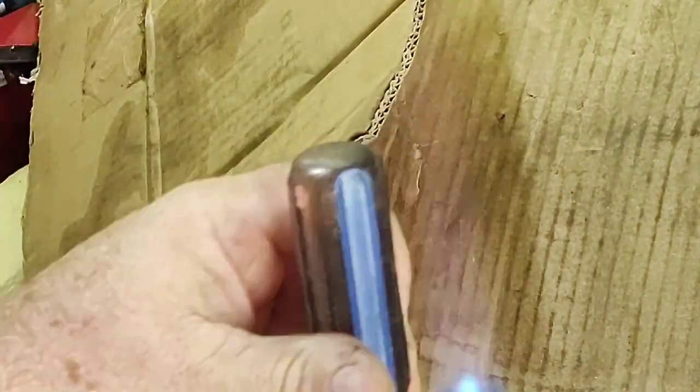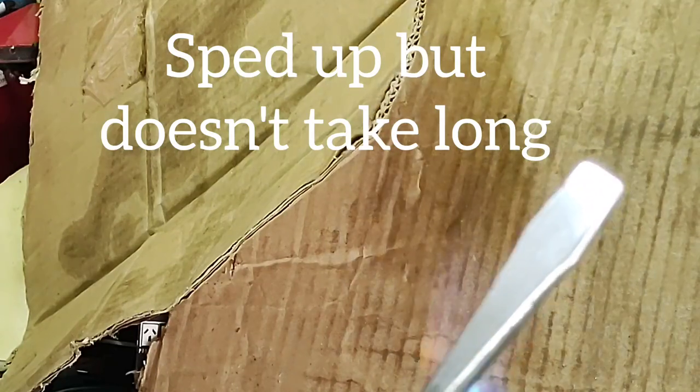So you've probably noticed the steel. I've actually had to shine it up in between the hardening process and this now. So it's nice and shiny. That's how you can read the colour. The colour indicates the temperature of the steel, and we're looking for that dark blue colour. And then we quench it like I just did. I'll go through now and you'll see how I temper the rest of these two.